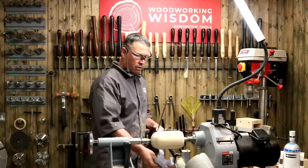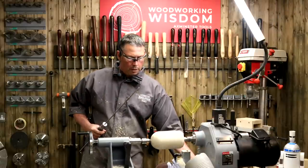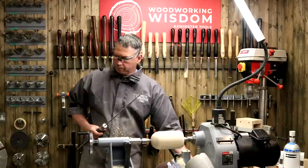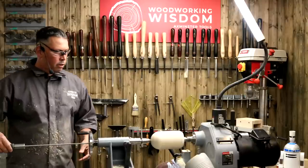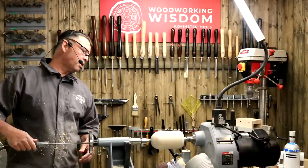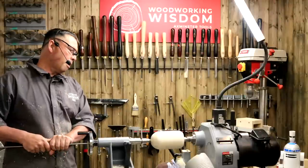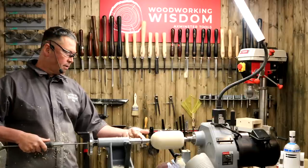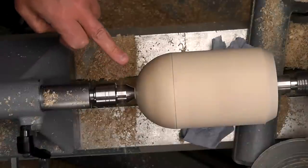There we are. Okay, so we'll just pop a hole in this one. I'm going to do this at about 1200 revs. So nice and gently to start with. Make sure it goes into the live center, and then you can start drilling. Like I say, the shavings will come out the exhaust in the actual live center here. You can see them coming out.